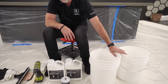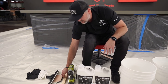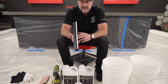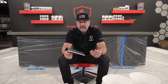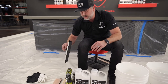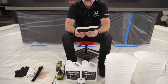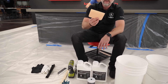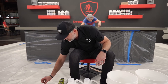For mixing, two five-gallon buckets. Drill and paddle mixer. I've got a five-gallon stir stick and a one-gallon stir stick for the epoxy pigment. And then this is one of our notch squeegees that we cut down to make smaller — I like to use this to spread the product quickly. You don't have to have one, but it does make it go extremely fast. We also cut down our flat squeegee the same way with a skill saw. Make them any size you want, or you can use a bondo squeegee — we've even used cardboard. It doesn't really matter what you use.